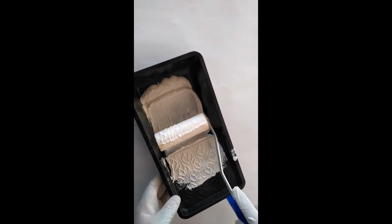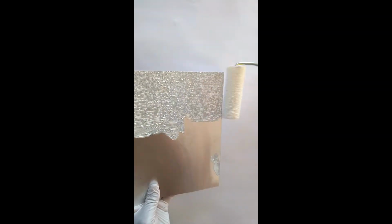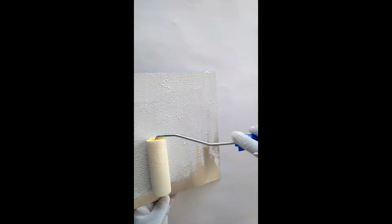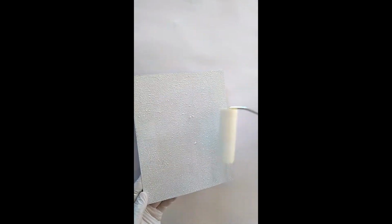We take the first aluminum plate and apply the primer; one load of the roller has been sufficient, and so we repeat one after another until the 4th plate. Once finished you have to clean the bucket and the roller well with water. In this way it is ready for the next phase. Once the plates are finished, you have to let them dry, between 1 and 3 hours depending on the weather, before continuing with the second phase.